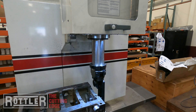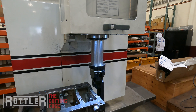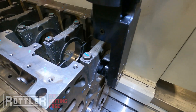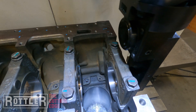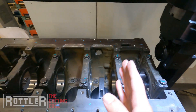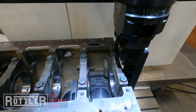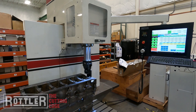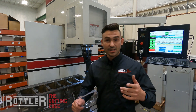I'll see the spindle turn on, and once I'm there at the bottom in the location I'll give it full feed rate at 100%. Like I say, we're just cutting air right now because we just want to make sure — we're checking the program. We want to make sure this goes all the way through the other side and that it retracts out right. That's just to make sure before we go down and do these sequential mains. We want to make sure this is going to operate correctly and we're not going to have any crashes. You'll see it'll pull away and retract back up.